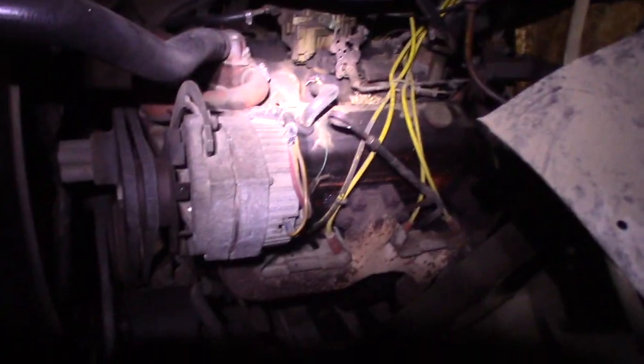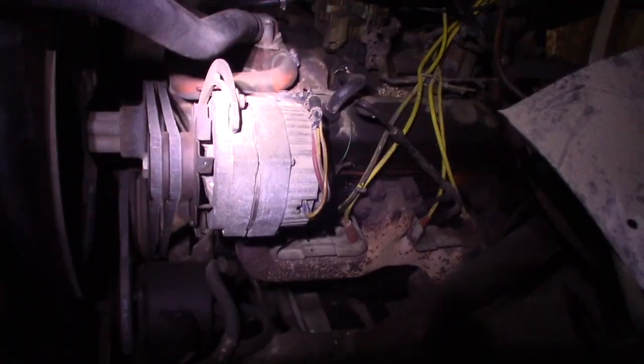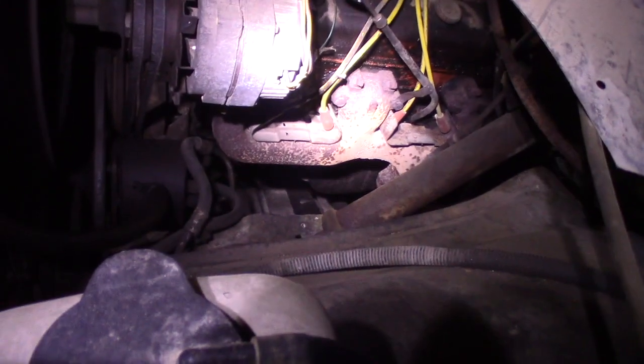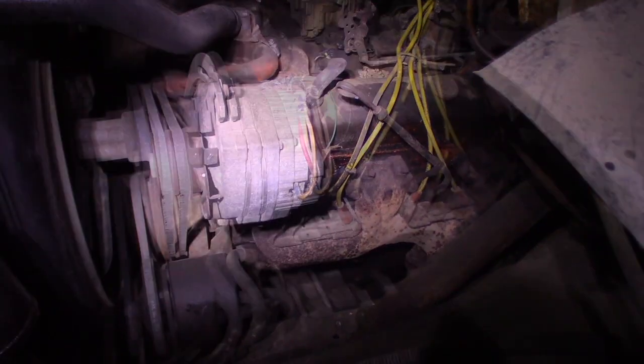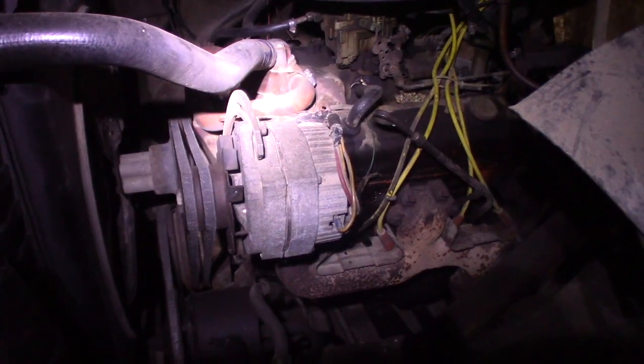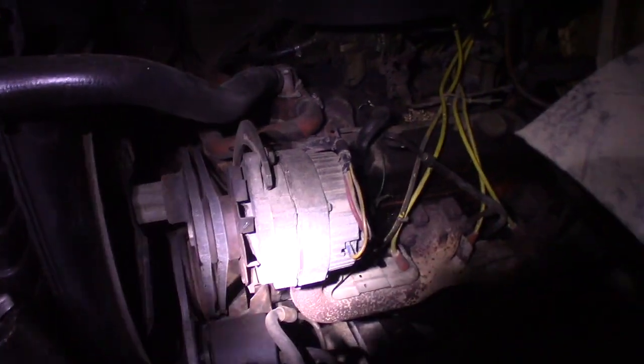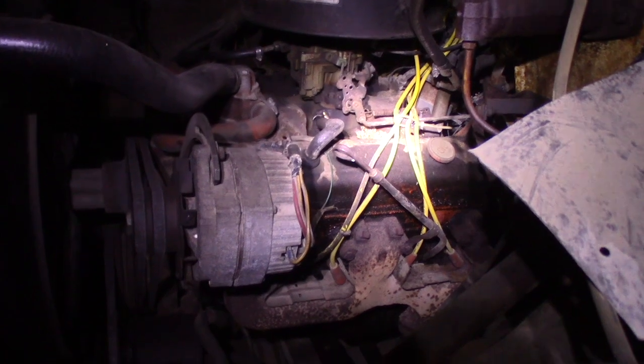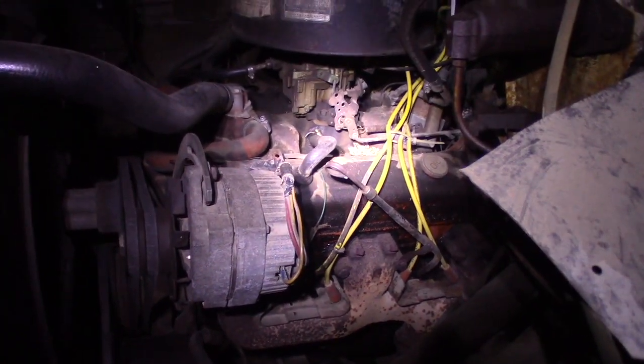This is the dump truck motor. I know that Elderly and I had asked about it. Haven't really had a chance to do anything. It continues to pop out the carb. Dad's got it tuned really rich because it gets much worse when it's leaned out. It's some sort of industrial 350, we think. When it tries to rev up, we get backfiring, mostly at the carb, a little bit out the exhaust as well. Before bringing it here, I know that Dad replaced all the vacuum lines on the truck, and that made a serious improvement for the thing.